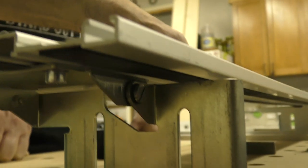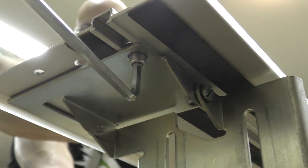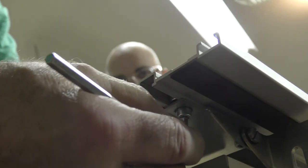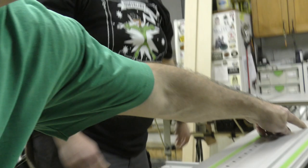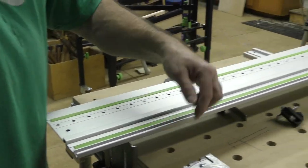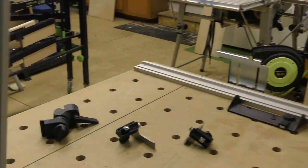I'm gonna take my 5mm hex key, and I'm gonna use the short arm so I can get leverage to tighten it. I'm gonna put it in here like this, and you notice that lever. I'm gonna tighten it. I'm not gonna kill it, but tighten it enough. But check this. You see how it's in the pin? There was no movement. So it's perfect.